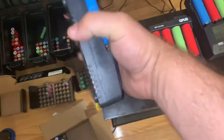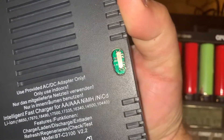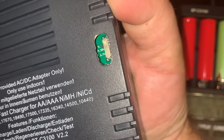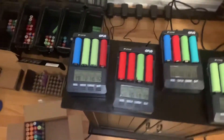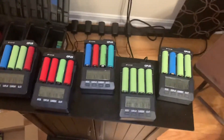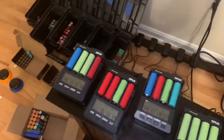These things can test other battery types — you can pop the cover on the back and flip a switch to different voltages: 3.7V, 4.35V, and 4.2V for the 18650s by default. I drilled a hole in one of them just so I could flip that switch easily. I haven't done it to the others — I was just fiddling around with that one.